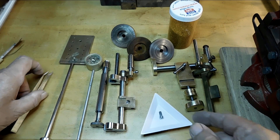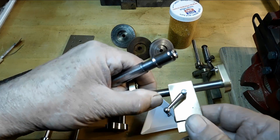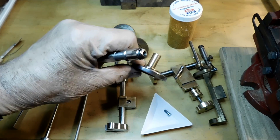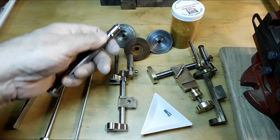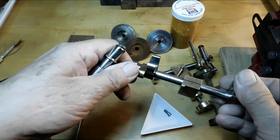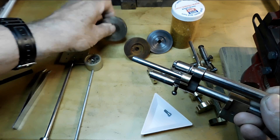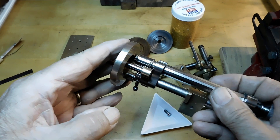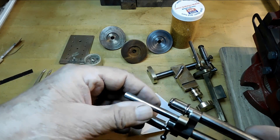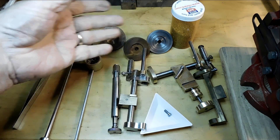In the next video I'm going to mount the screw in the end of this holder, and then I'm going to take a shop-made screw polisher that I made in my shop, put it on the lathe, and use an iron lap with polishing paste to polish it flat — get it nice and flat and contoured. Then I'll move it over into this holder that will be held in a vise and hand-turned. I'll be using a bell metal lap and doing the final polishing. Actually the final polishing happens with a boxwood lap. When that's done, it goes down into the cellar and it'll be hardened and quenched, then it comes back up and goes through that process a second time.